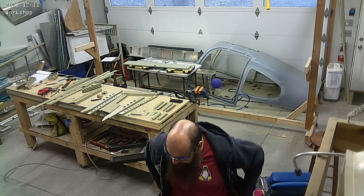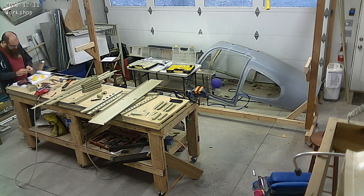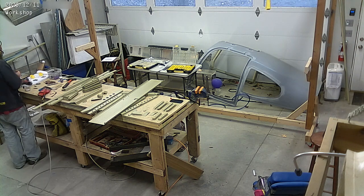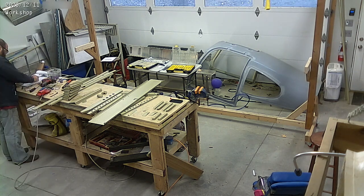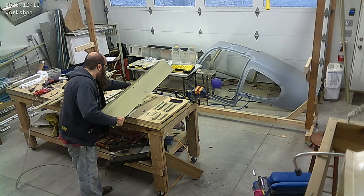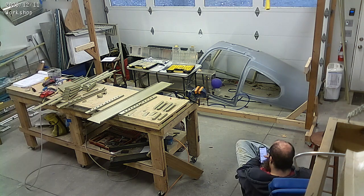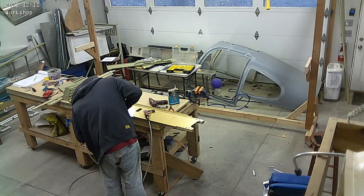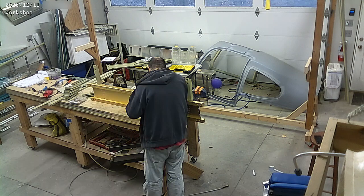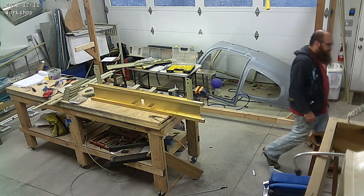Here is the day after priming. I always let it sit for a day, and you can see me off in the corner there — I am riveting all of these parts together, and I am putting the nut plates in, and the stacks are moving around. This is probably my favorite part of the airplane building process. It's when the parts are ready and they're primed, and you're riveting things together, and you're really getting things to work out, and you're getting big airplane assemblies out of it.